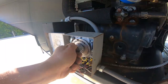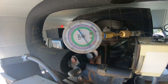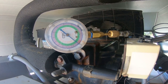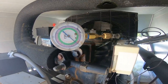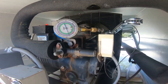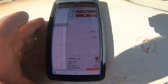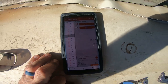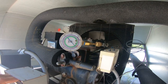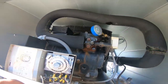She shut off that time and it's in the positive, somewhere around a couple of pounds. Came on at about 25, shuts off in a positive around five pounds. She's not rising back up, and when we pull it out you want her about 25-28. At 27 we're negative four, so we're going to be able to keep our box temperature just fine. We're holding there, not rising up. You don't want to rapid cycle it back and forth - that's something to watch out for.